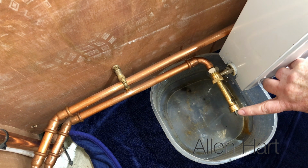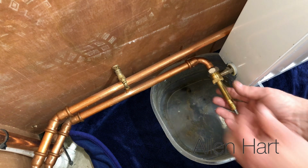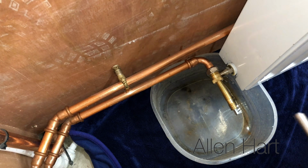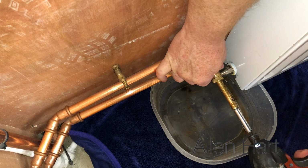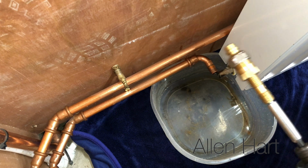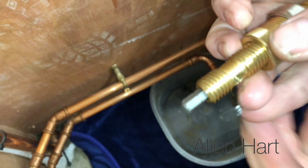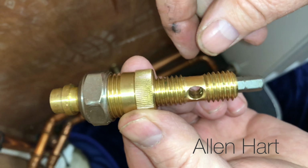So now what we're going to do is connect the drill into this. So we'll unscrew the top off there, and it gives us a bit more room. So we've just got a little drill, so we're just going to take a bit out the end. So I'm just going to hold that there, so it tightens on, and then see how easy that was? That's absolutely brilliant. So that's your Monument olive puller, but it's the new one that's got the drill bit on it. So I'd much rather use this one, obviously, than the older one.